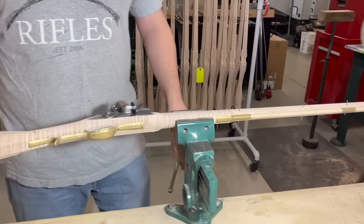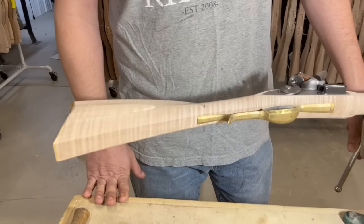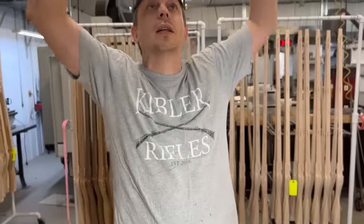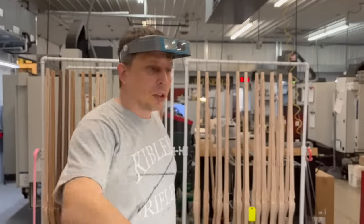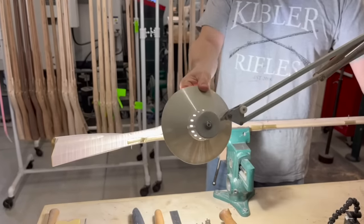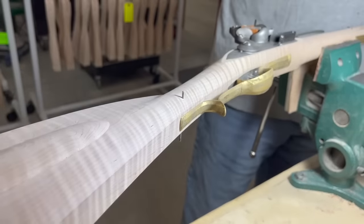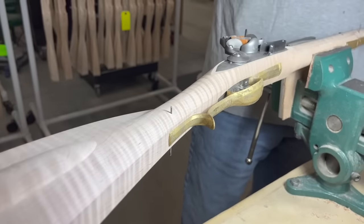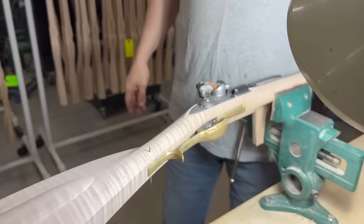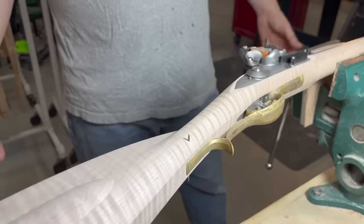They cast a shadow more, and shadows are very important when sanding a stock. You want directional light. You don't want fill light. Fill light is bad. Fluorescent lights and LED overhead lights are fill lights. With an articulating light you can tailor where the light is coming from. So you can move it, and it'll reveal any kind of little defects that you have on your stock. So you want to make it look as bad as you can while you're sanding it, so in ordinary circumstances, it looks as good as it can. You're constantly going to move this light in order to see the stock best during the sanding process.